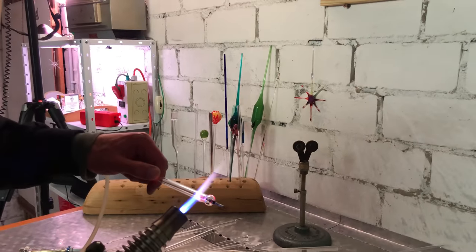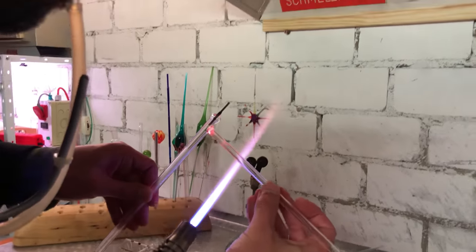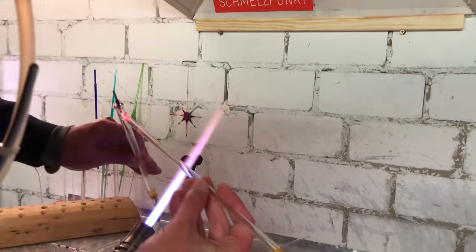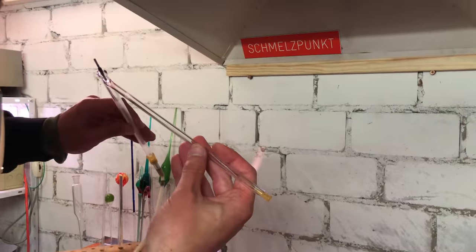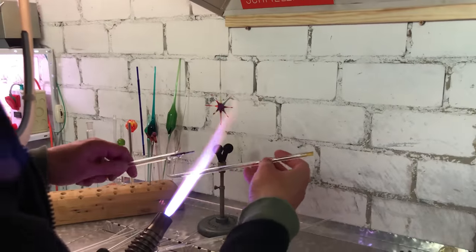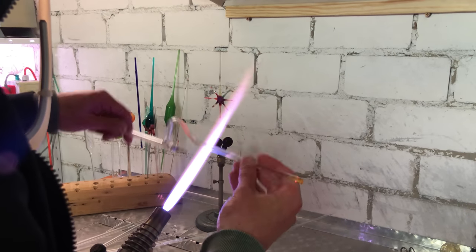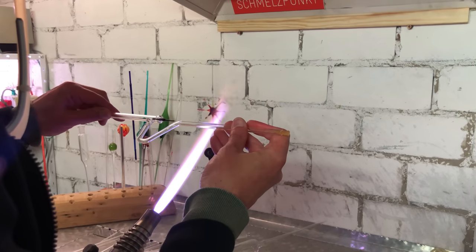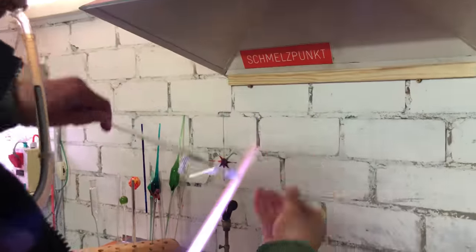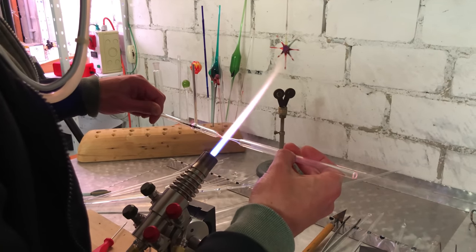To be able to melt on an electrode on the opposite side and at the same time have a way to blow into the tube, he creates a hole in the side and then melts on a second glass tube. He then bends it so that he can continue to turn the glass piece in the same axis. When blowing glass, one is often confronted with difficult questions - in what order should you perform the steps and how can you hold the glass part while you work on it? What you see here is a solution to such a problem, and it is fascinating to see how a professional approaches these questions.